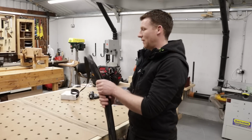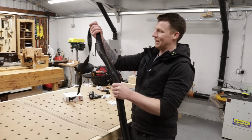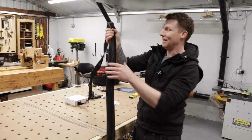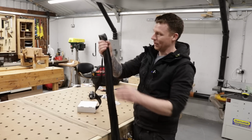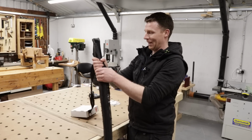Okay, so we're almost the whole way down. Now the best technique to do this, because it can be kind of frustrating if you're not used to this stuff, is to just, like I said already, get the bulge on the front. So get it to widen out, catch that, and just push that on down. And it will fly down the hose. You'll move a few inches at a time. If you try and catch your end and pull it, if I pull from here, the whole thing just locks down, locks onto the hose, and you will have a terrible time.